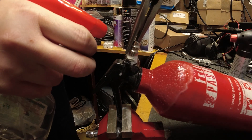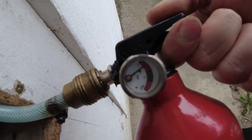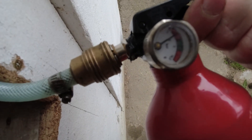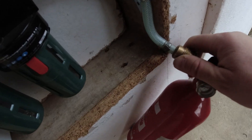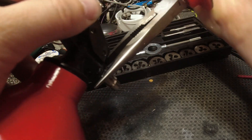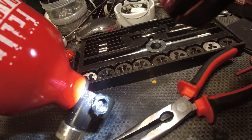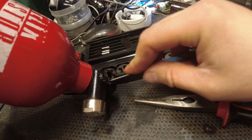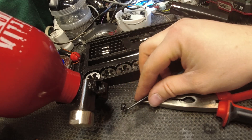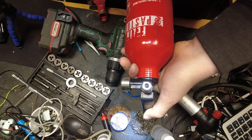So yeah, a little fail. I got the idea to slowly cool it with air but everything went sideways, literally. I didn't give up. I used a window cleaner on hand to cool everything and decided to test the tank before deciding what to do next. Visually everything seems to be okay, so I connected it to the compressor and it was taking pressure fine. But on the blowing-out part I saw that something was wrong, so back to the drawing board. I tried unscrewing the fitting and found a problem: as I pushed the hot metal into the plastic, a plug had formed. I easily removed it and before testing again I put teflon tape on the threads of the fitting just in case, so that there would be no air leakage. The handle creaked a bit but I lubricated it with silicone oil spray and it was okay.